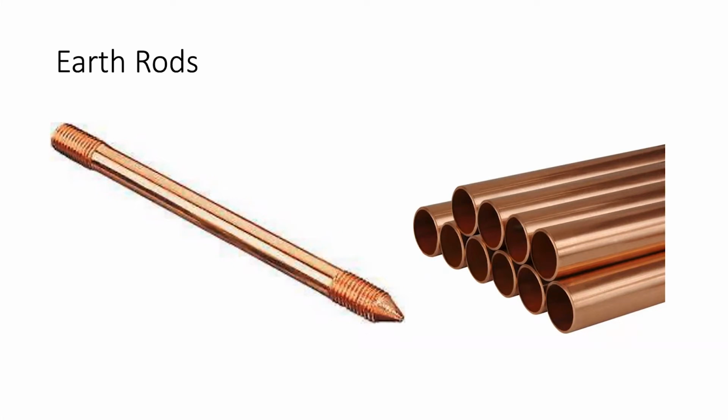Do you know what I've done previously? I've used 15mm. No, I've bashed the end of it flat with a hammer, and you get a kind of knife effect, right? Yes, and it does go down. Yeah, 22mm just goes in. It doesn't. Right. You can welt it with a sledgehammer, and it sometimes buckles if it's a big flint. Yeah, no, I think we covered it. Okay, we covered earth rods.